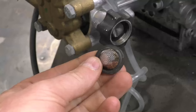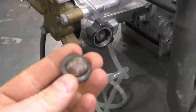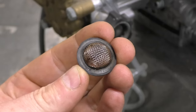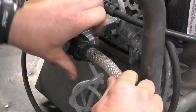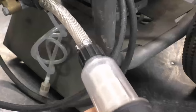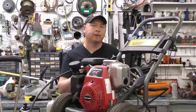It doesn't really matter if the screen is not totally rounded. Also, if you're missing the screen you may find a water leak where your hose screws in, because the screen also acts as a washer. If you're using water from a lake, a small screen filter may not be enough — you may have to use an inline filter. You screw the inline filter onto your pump, then screw in your hose from the lake or whatever water source you're using, because it doesn't take much dirt to get into your pump and totally destroy it.